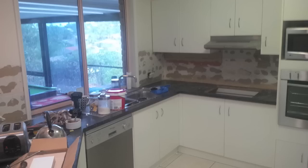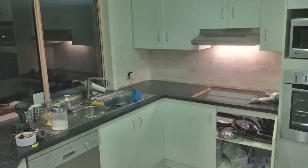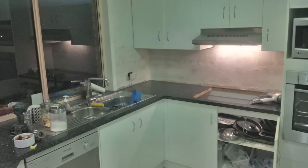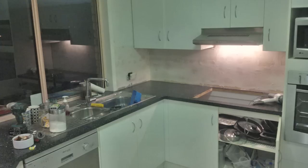What I've done is basically just screwed a new piece of gyprock on the damaged bit, then skimmed the entire area just to make it nice and flat, and sanded it. A lot of guys wouldn't bother doing that, but it's the best way to get a sound surface — just skim it and sand it all and you've got a nice flat surface to tile.